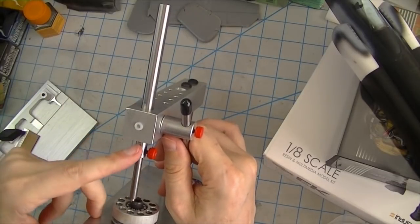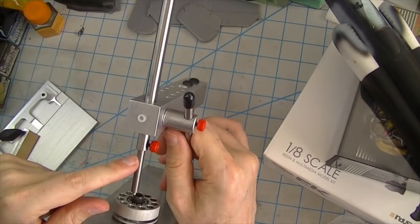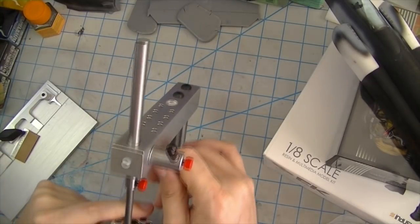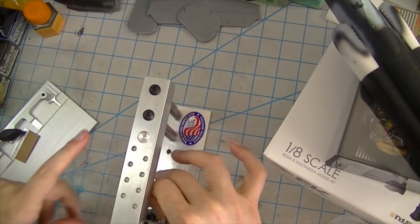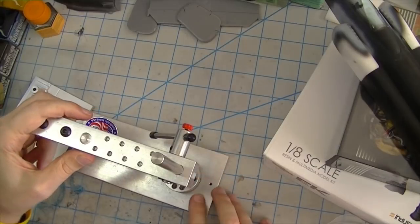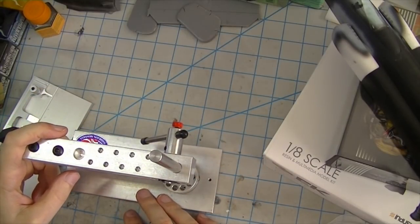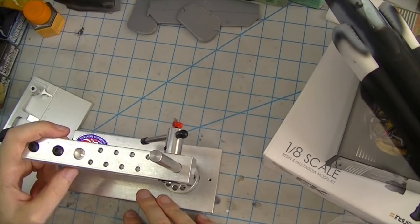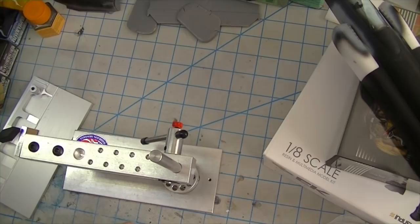One is that the bore on the end of this ram was 3/32, and these punches are nominally 1/4 inch in diameter. The other thing was how to attach the die of my UMM punch and die set to the base of the press. Not a problem if you've got machine shop facilities, which I don't anymore, and all my punch and all my tap and die stuff is in storage.